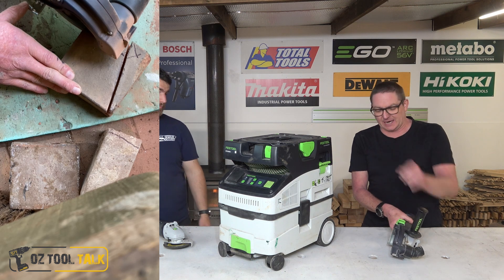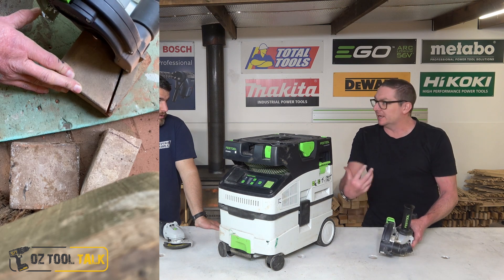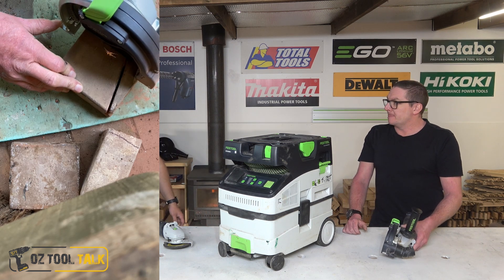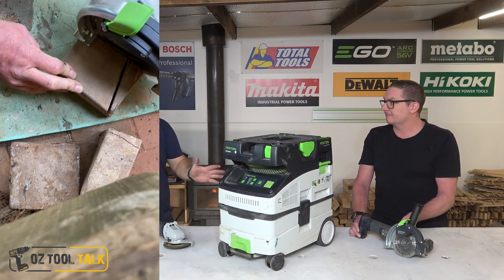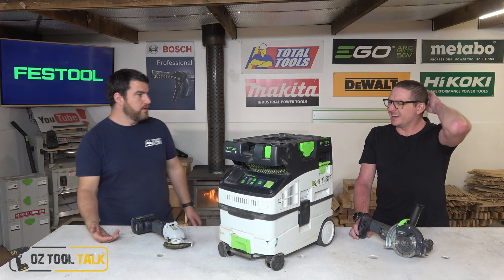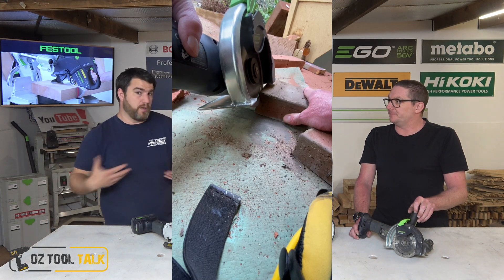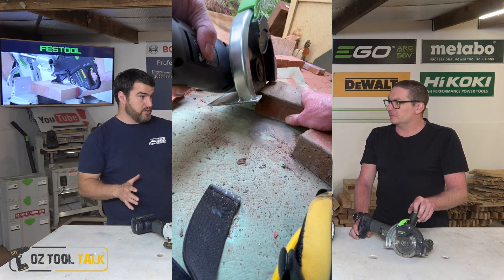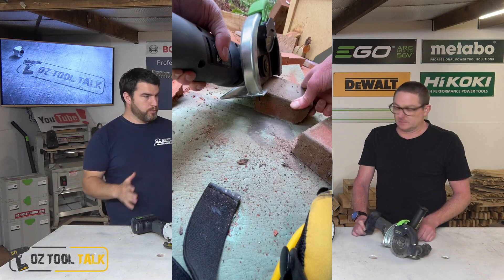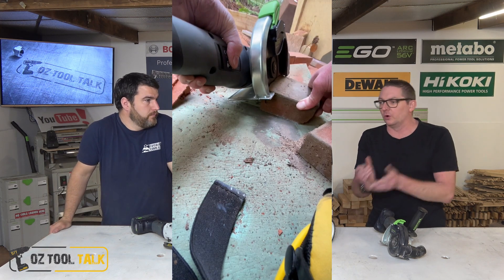Still use a mask because humans are involved — if you wobble it or lift it while walking along, you'll get small puffs of dust from human error. When it comes to concrete cutting, I usually try to pull concrete cutters, but that's not how this is designed to work at all — the dust extraction goes to hell if you pull the unit; it must be pushed. When you do push it, it is mint. You need to be confident with it and walk it forward.